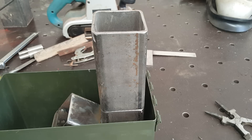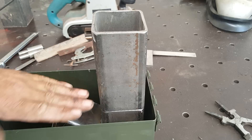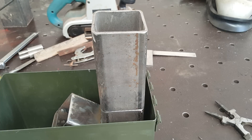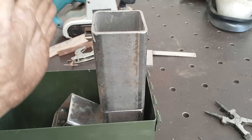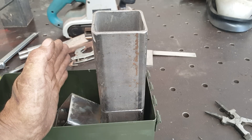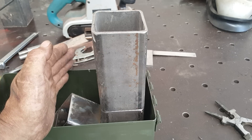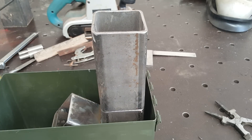I was looking at some ceramic insulation, so I'll be putting that in around the sides. I'll add a sheet metal piece across the top and a vertical piece here — so really just one across the top and then a vertical piece. Put the insulation in there, set that down in there, and weld it on. That'll hold this in solid and insulate the ammo can from the heat so you can set this on a wooden table or whatever and not worry about catching it on fire.